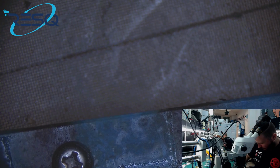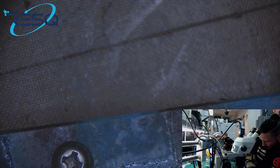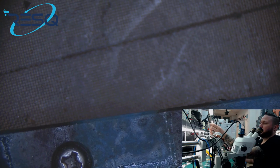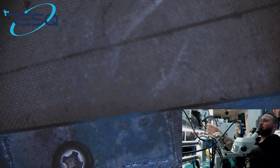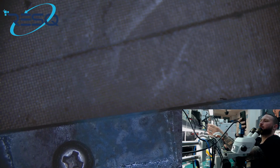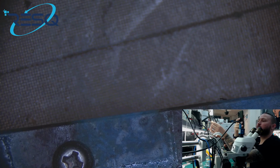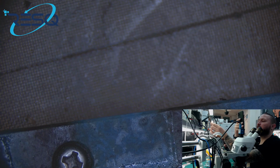So just connect the power supply and perform a boot up. And what we need to see here is exactly this. So iPhone 8 Plus board without RAM, only CPU side of the RAM you see, and that's the right behavior on power supply.